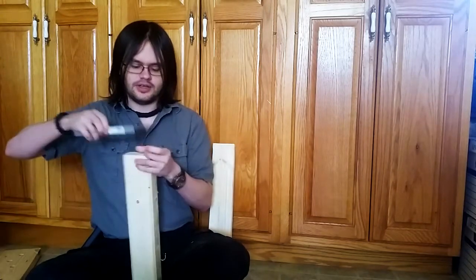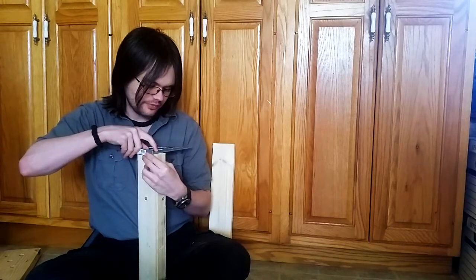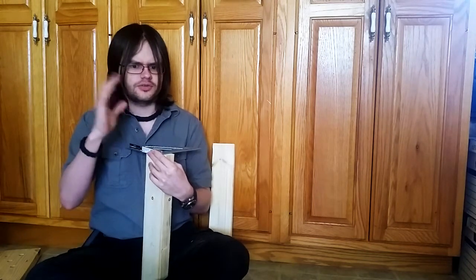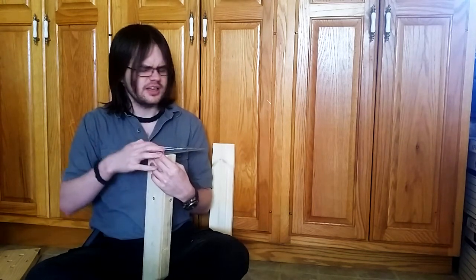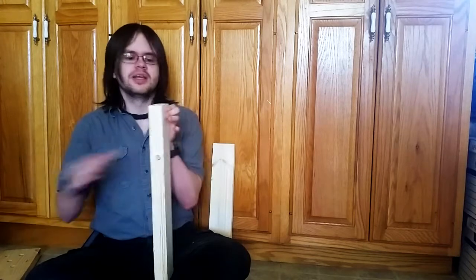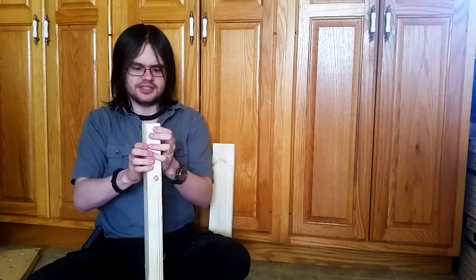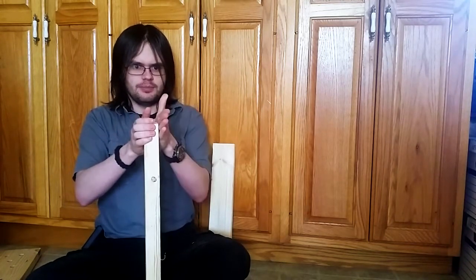How far in are we going to come? Well, let's see how thick it is for starters. That is one and a half, so half of that would be three quarters of an inch - yeah, that's probably fine. So I'm going to take it in half right here and only take halfway in on the body of the bench itself, so that they'll make a nice flush line with the side for reasons that you'll see later on.